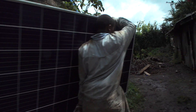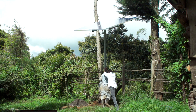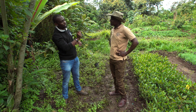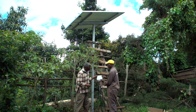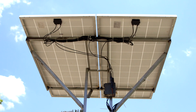Two: the solar panel. This should be installed in an area that has no shade. The panel takes energy from the sun and turns it into electricity. We have panels ranging from the small ones we see in calculators to big panels. For a majority of pumps, we do not need such a big solar system — we need something sufficient, matched to the pump, which normally comes as a package.